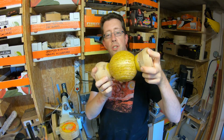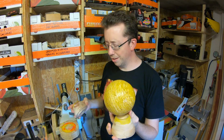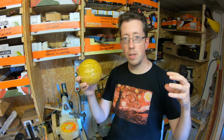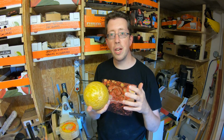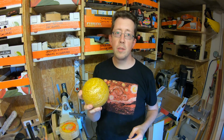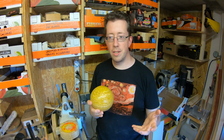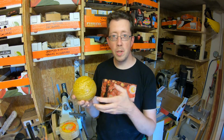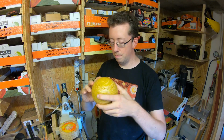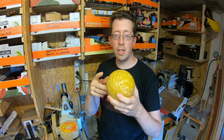I used these sphere chucks on the lathe, as you saw, but I've recently discovered how I should actually have used them. The way to use them is to clamp them in and then only take off the high spots. Basically go along, and where it takes off material, well, it does. So you shouldn't try to, as I did, actually make a sphere while you have them in the sphere chucks. You take off the high spots, then you stop it and turn it. Spin it again, take off the high spots, and so on.